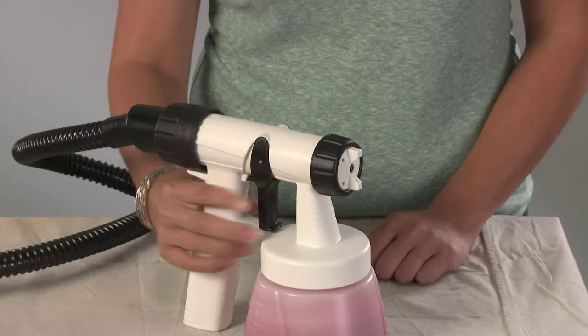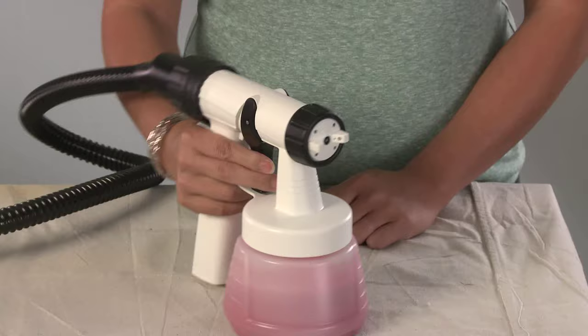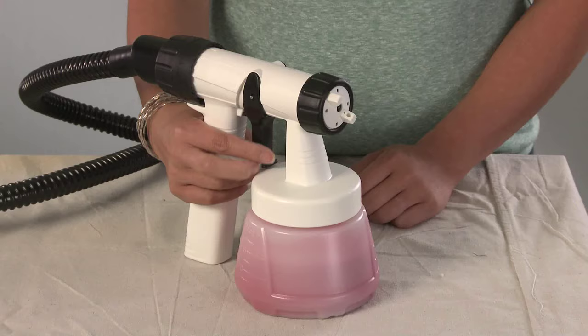Positioning them in a horizontal position will result in a vertical spray pattern, allowing you to paint in a side to side motion. When positioned diagonally, the result will be a small round spray pattern. This pattern is ideal for small or narrow painting, like chair legs and spindles.